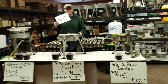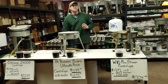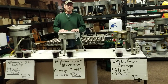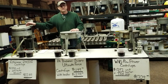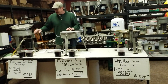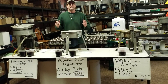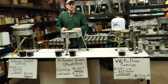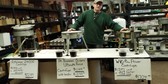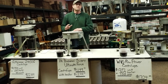We are raising our pricing — again, $1,149.99 and $1,299. We've been in business for over 10 years and I've never had a price increase. I'm sorry, we have to — but we're not raising it by much. As you can see, we're still half of his price — $400 to $800 less than FilterMax. His is a higher G-force, which means at 5 gallons per hour you run ours at 4 gallons per hour and get the same cleanliness. Bowl speed isn't everything — it's bowl speed, size of the bowl, and the feed rate of the oil. When you're paying more money, what you're paying for is to produce more oil.